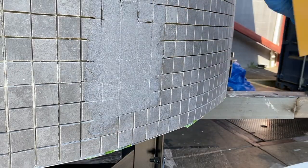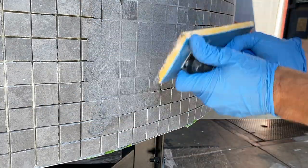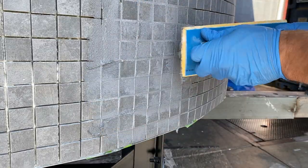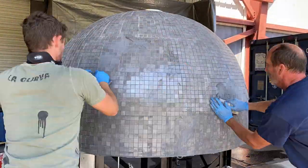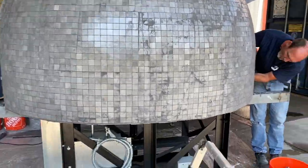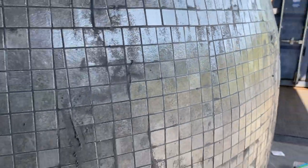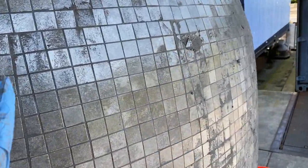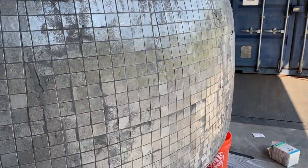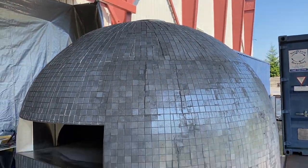As for the application of the grout, I still always suggest working your way from bottom to top, making gravity work for you, not against you. The tool I'm using is just your normal stiff rubber grout float, and I proceed to spreading and smoothing out the grout into all those crevices as much as humanly possible. We finished off the first bucket and it's drying nicely. The directions say to let it dry for approximately 20 minutes before starting the first wash, so we let the middle section dry and then complete the grout system.